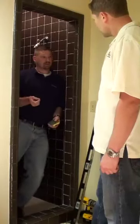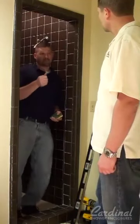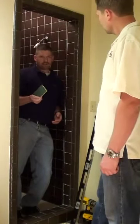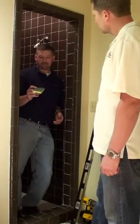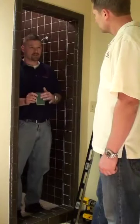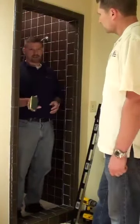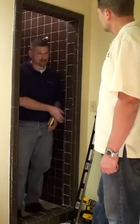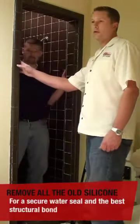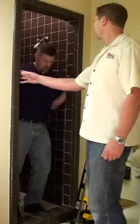A lot of times you'll use a single-edge razor blade, or one of the best things is a brand new Lexan putty knife — they have a real sharp edge and won't scratch anything. On harder tile, a Scotch-Brite pad works great. Use the more abrasive one for regular tile or glazed surfaces, but not on culture marble because it will scratch. It's really important to get all the silicone off so that when you apply new silicone, it adheres to the tile and not the old silicone.